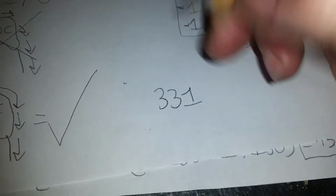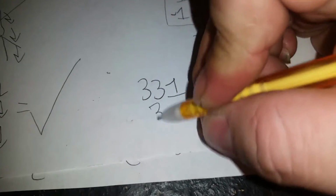If you take a look at this one, that's a 330. And here's a prime example of what I wanted to show you. Now you see how it says 330? Alright, well you can also see these capacitors written out like this, or something like it, or with some crazy letter behind it. Let's see, do I have any that has a letter behind it? Like you saw the way these 104s are right here. It said Z. I don't know what that Z means, but I know it's a 104.